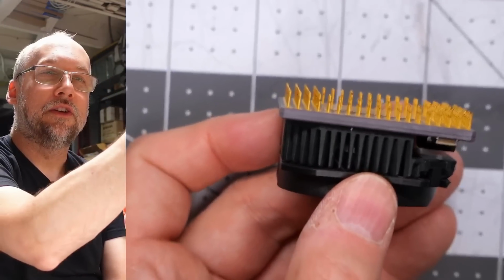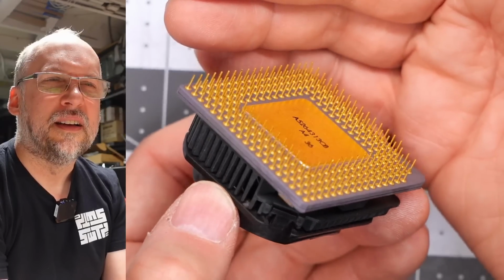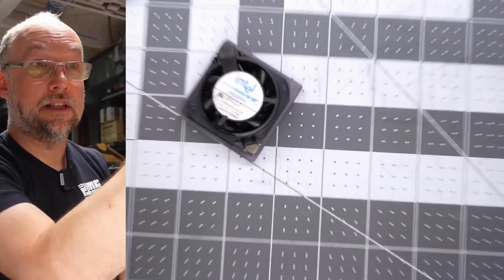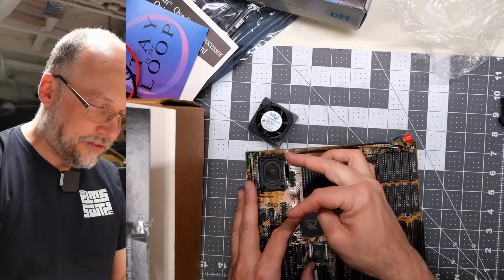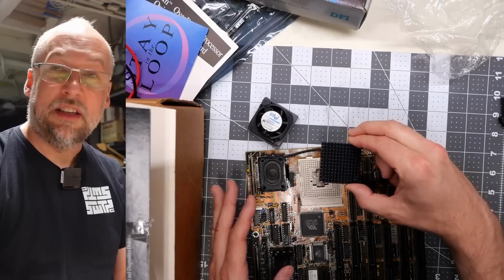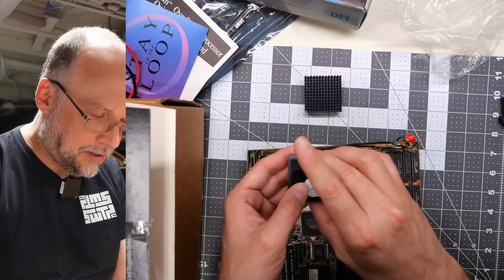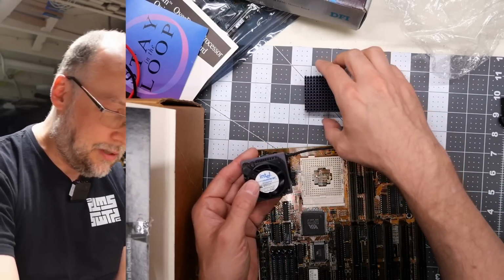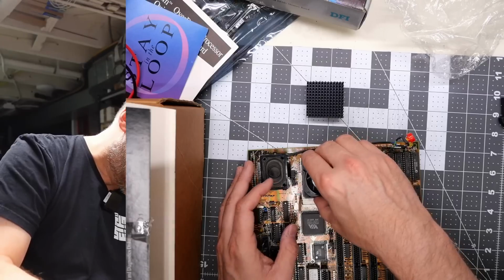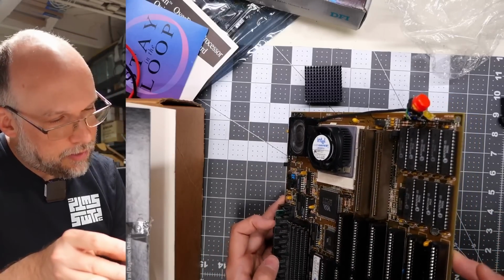And how do the pins look now that we cleaned them a little bit? I don't know. Not great. There's definitely still remnants. Okay, well, let's give it a try anyways. All right, we have a 486 motherboard here with a ZIF socket. So we are gonna try it on this. This board is set up for 66 megahertz. Or 33 megahertz, which, if I recall, is the correct setting for this type of CPU. Now, see, pin 1 goes right here. Look at that, my straightening worked. Oh no, it didn't. Not quite. Alrighty, CPU looks to be seated correctly.